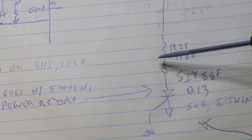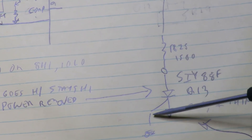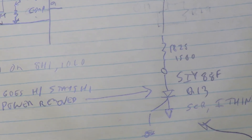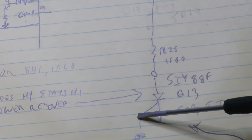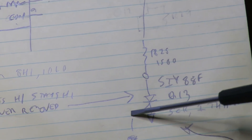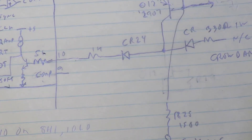I finally figured out it's an SCR — a tiny SCR in a TO-92 package. The reason they use an SCR is so that once a fault condition shuts it off, it latches — this is a typical crowbar. On a 120-amp supply you don't want to actually short the output to ground, so instead when an over-voltage condition occurs it drives the gate of the SCR, turns it on, that goes low, and causes a shutdown that latches.